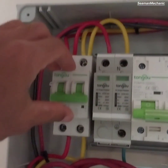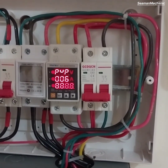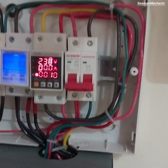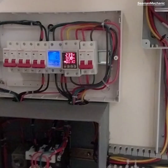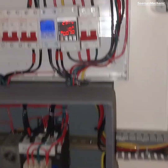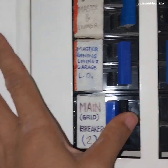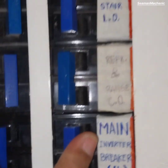Switch on the AC out to put load on the inverter and wait for the voltage and current protection device to normalize. To change over the power supply from grid to inverter, go to the circuit breaker panel, switch off the circuit breakers from grid supply for both essential and non-essential loads, then switch on the circuit breakers to take power supply from the inverter.